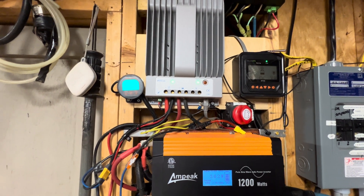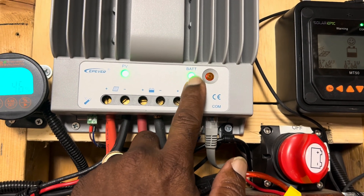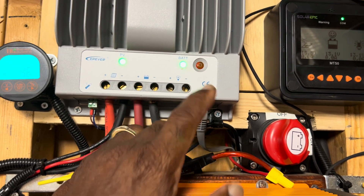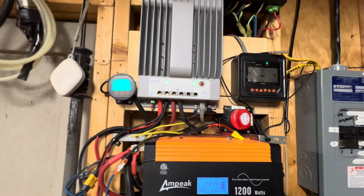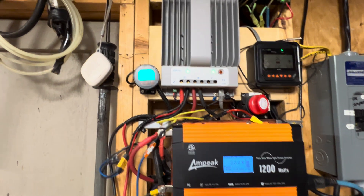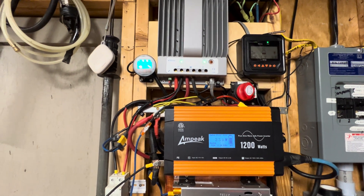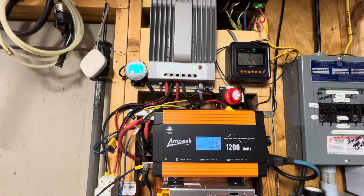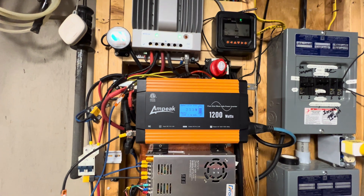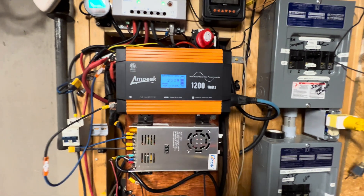I disconnected, but as soon as I turn it back on it'll work. This right here is the battery indicator — as long as it's lit up you know it's connected to the battery, but if it's red that means your battery is getting real low. I'm gonna turn the solar panels back on — see, it went back to blinking. There's also a little monitor showing the percentage of the batteries. It reads 4.5% right now because I was reprogramming that monitor three minutes ago. The batteries were actually about 85% charged when I last checked.